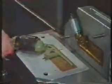The real attraction of investment casting is that you can have a whole range of different components all undergoing the same basic procedure at the same time. These wax patterns are for surgical implants. As they're so small, they're built up on a frame known as a tree. This is very economic because it means you can get a lot of small castings from one melt of the furnace. They need careful handling at this stage as they're very brittle and any breakages are costly.